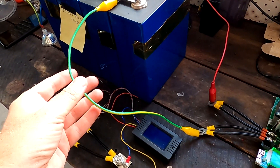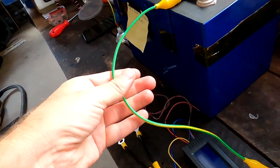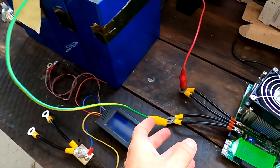You can imagine what would happen if we extend these cables with a really long cable — say 100 meters. You might think we'd get different results, but that's not the case. It just takes longer because the battery still has the same capacity — 280 amp-hours. With a longer cable or worse connections, the resistance is higher so the current is lower, meaning the battery gives those amps over a longer period of time. We will have exactly the same result regardless of cable length.